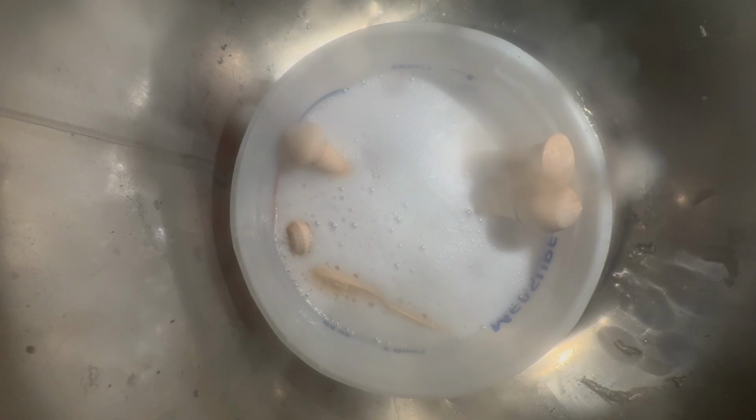And this is how I actually get pretty much anything that I say I've saturated with oil. Rather than let it sit for a couple of days, I can do it in the matter of about 15-20 minutes usually. I'm not going to go through the full process here with you guys, because it's literally this, and I just do it 4 or 5 times until these bubbles go away. So I'm kind of watching to see how high they're getting, because as soon as it hits a point, I'm actually going to release the vacuum and put air pressure back in there.